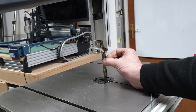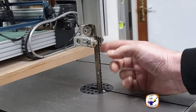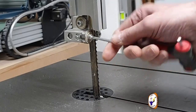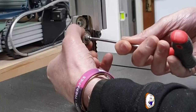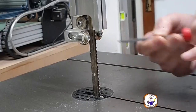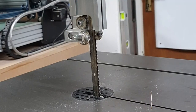The first thing to do is loosen off the guides. Around the blade you have these guides — roller bearings — which keep the blade aligned when you're cutting. Some bandsaws have toolless releases; this one has allen bolts. Loosen off the two side bearings and move them out of the way, then loosen the one at the back and pull it away from the blade.